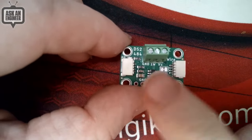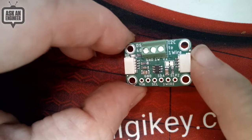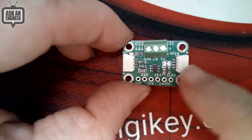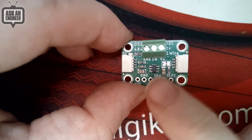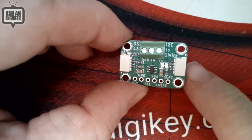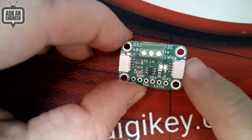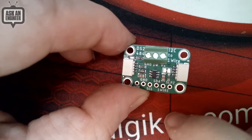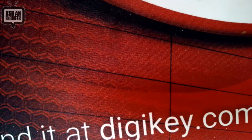It's a very small chip from Maxim — now Analog. I'm kind of excited about it because I'd like to have CircuitPython support, and then with Blinka, if you have a Raspberry Pi and want to connect to one wire sensors or devices, you'd have an I2C to one wire converter for that. The datasheet is very minimal — there's not a lot you do at the one wire level; most of it's at a higher level.